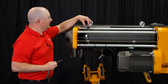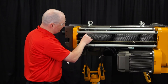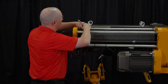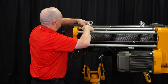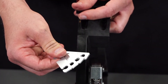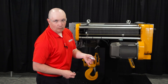Now we're going to move on to the very top socket head bolts — these are the longest two on the Rope Guide. Be very careful as you do this, since even though it's mild spring pressure, there is some spring pressure here that will pop open. Just be mindful and careful as you're opening this up — that's why it's always a good idea to wear safety glasses. And there is that pressure being released. Also, this Rope Guide incorporates four shims. Make sure you do not lose the shims. The shims are manufactured so that one side is slotted and the other side has a through hole, which allows you to install one bolt and let the shims hang off of it until you install your other bolt.